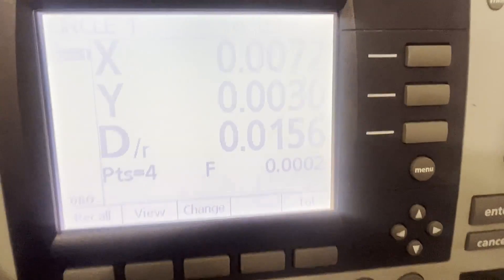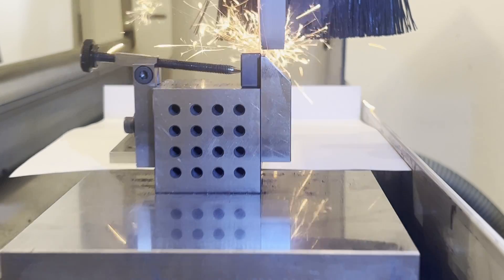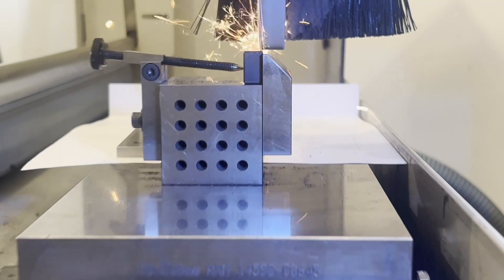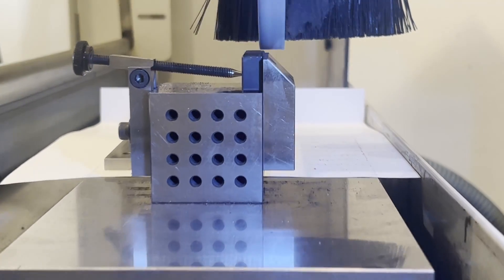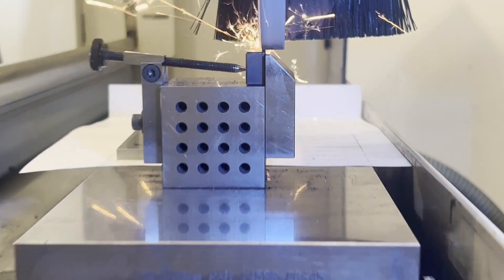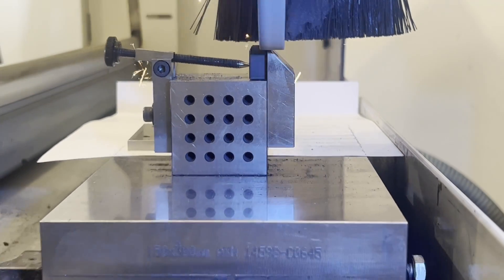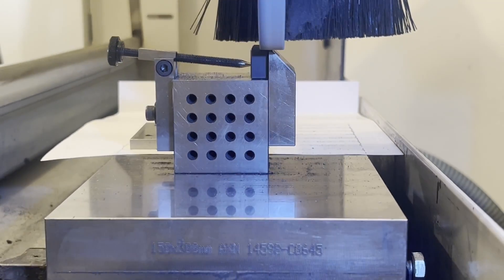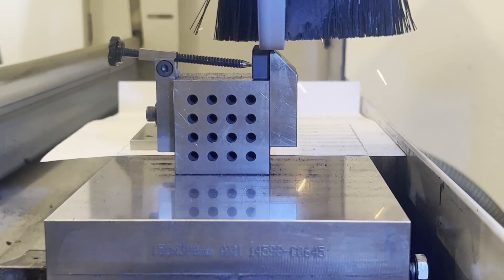The digital readout tells us the diameter of the circle that makes that fillet, and it is 15.6 thou. I usually anticipate about a 16-thou grain diameter for a 60-grit wheel. So here is our first pass using this process — I'm taking a 4-thou step over and a 7-thou depth of cut, which puts the 4-thou at a quarter grain diameter step over. On the next part I bumped it up to 6 thou and it went just as well.